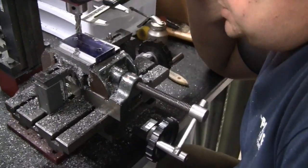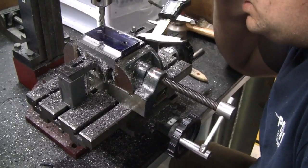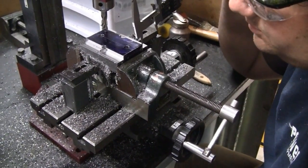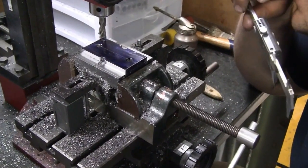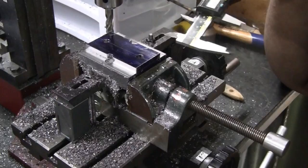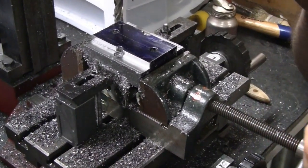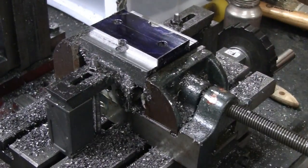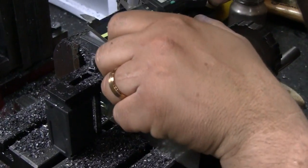No. But I changed mills, so we got a smaller 3/8 mill. It's shorter. Right now the depth is where I want it, but I'm creeping up on the width here. My target is 1.625, so 1 5/8 thereabouts. Maybe a little bit undersized. We'll pull it out and put it in the lathe and try it. We're less than 10 thousandths over right now.